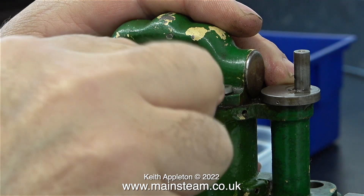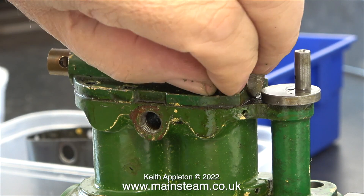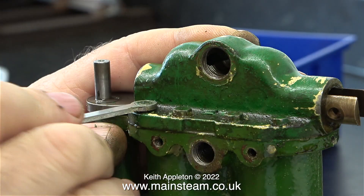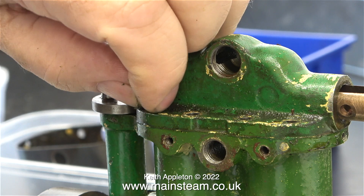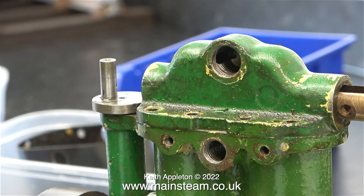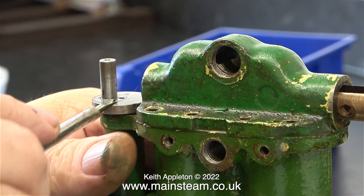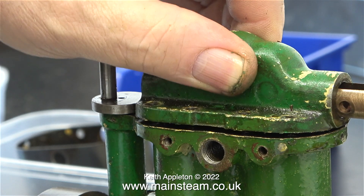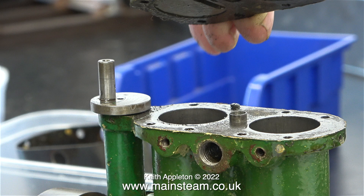These are four BA bolts with slightly larger heads than usual and it shouldn't be a problem if I have to drill one of them out of the cylinder head. With one set of bolts removed from one side I turned the engine round and repeated the process — this time all the bolts were fine. Usually things go wrong on the very last bolt but thankfully that didn't happen here. Once the last four BA bolt was in the box, I gently applied a little bit of leverage using a very small screwdriver to lift the steam chest off the cylinder. The part of the bolt that sheared off was still stuck up out of the cylinder head. This bolt sheared because it was stuck very tightly — possibly it was a little too long to start with. There was just enough of the broken bolt sticking up above the cylinder block to remove it easily using a pair of pliers.